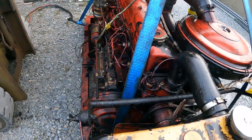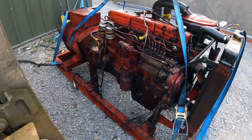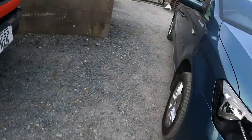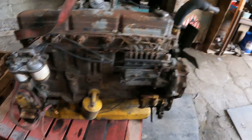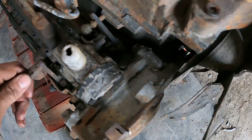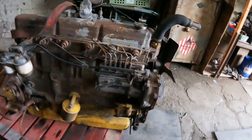It's been overheating for a while — helps when you put some iron in the radiator. These are getting really hard to get parts for. What we actually did was got ourselves another engine, had this one running on the stand so we know it runs. We're going to swap the whole engine and might have some variation to do in the injection pump, or potentially have to change the whole injection pump just to get the RPM right. I think that's a variable speed pump on the other one — this one's fixed.